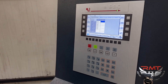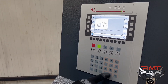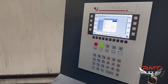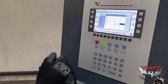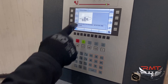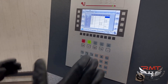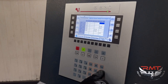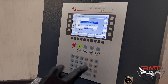I'll jump to step two — same thing, rotation for plate alignment. Step three is pinching — you can change the pinching amount if you need a little more or a little less. Step four is press roller reverse rotation and down. The reference roller goes down and the machine knows the reference point and center of the roll — it's 4.51 inches. Then for step five, 'Entrance roller up' means pre-bending.